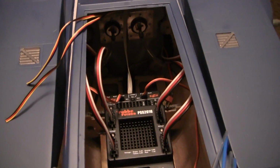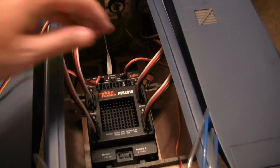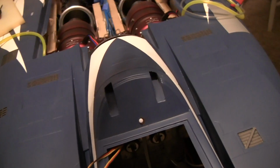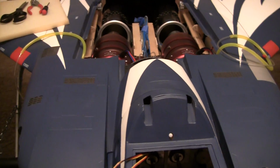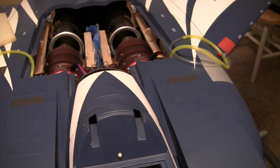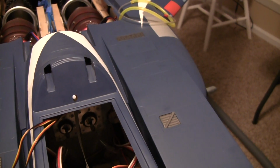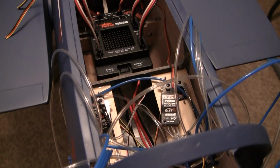Otherwise you'd have to buy the little separate decoders that clip on to the big leads, which you could do, like if you wanted to plug in your ECUs and your valves or something way down back there in the turbine bay. You just clip on one of those decoder adapters instead of the regular one, and you can plug in anywhere on this lead, or any one of these leads as you want. So pretty neat system. Still gotta do all the airlines.